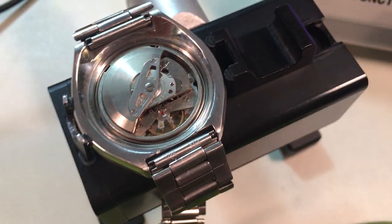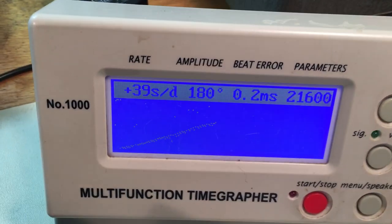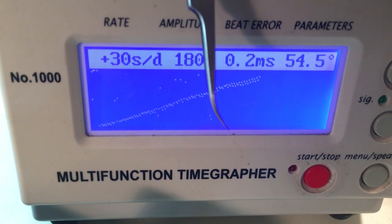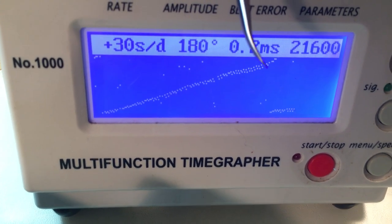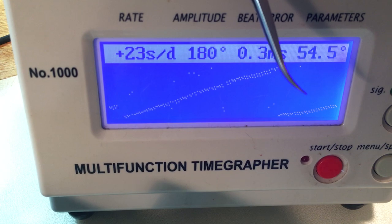Okay Jeffrey, it's time to do evaluations — I have your bullhead here. Let's talk about the numbers, that's always a good place to start. The numbers are low and messy, it's wavery. This is not a real happy watch, but I've seen worse. You can see the difference in angle — we're getting these drops and rises in amplitude.